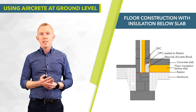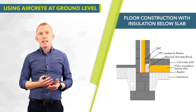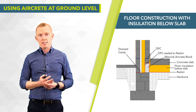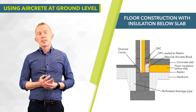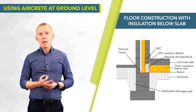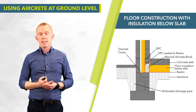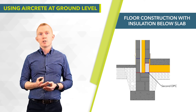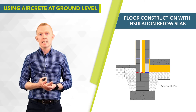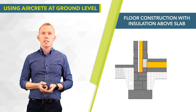The Mannok aircrete block has been introduced in line with the floor insulation to provide continuity of insulation between the floor and wall. Any water coming in through the outer leaf blockwork can easily drain down — the cavity is drained out to a drainage channel with a perforated drain. The only moisture risk is rising damp from below, so if that's a concern, simply introduce a second DPC underneath the Mannok aircrete block. That block is then fully protected and you get optimal thermal performance — a very simple detail.